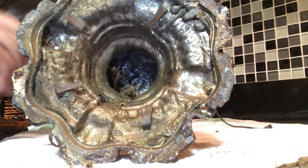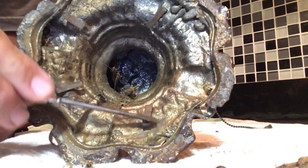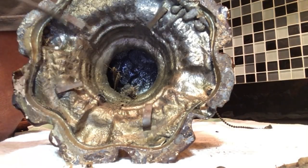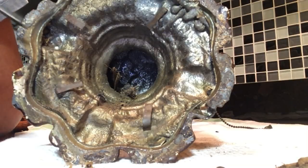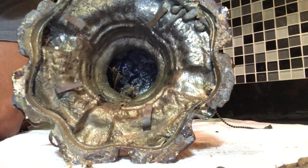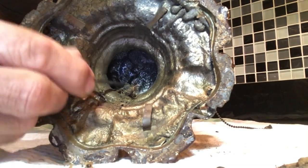and are fed through the two metal rods. Somebody also plugged up the hole where the wires would have come out to go to the outlet, which is somewhat unusual. We can see underneath here there are three metal clips, which would have originally held a metal bottom to this, which is gone. And deep inside now, you can clearly see the silver color, which lets us know it's spelter. Okay, so I've got one free right here, so this is just going to slide right out of there.